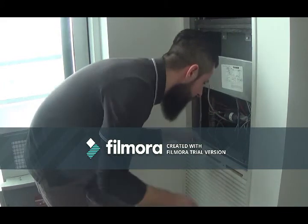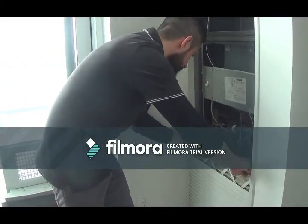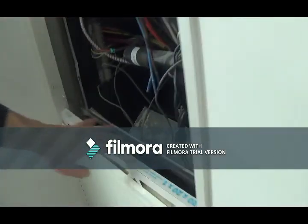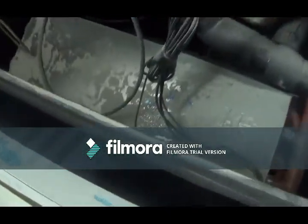The unit also has a sensor. I would like to try to take this out without making too much dust. Or you can just get your camera in there and look on the bottom. There's an overflow switch on the drain pan. It's like a safety. Correct, it turns everything off. What it does is if there's any sort of blockage in the drain pan, the float will catch it. It's on the bottom right of the pan.